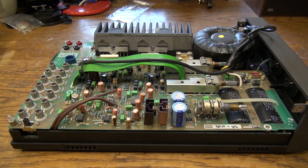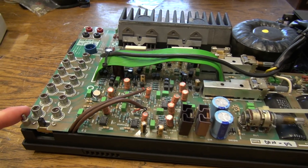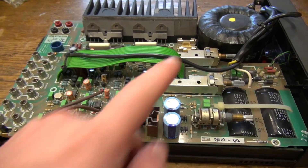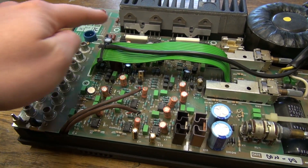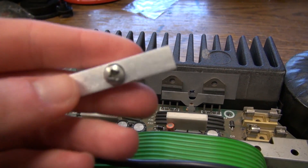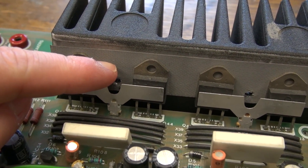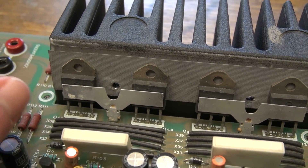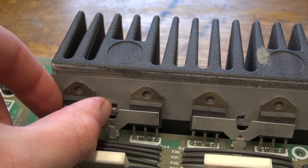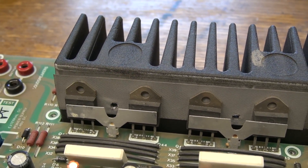What I have done so far is I removed the four screws holding the top cover in place, and also removed the grounding screw for the phono input. You can then remove the top cover, take out the screws all around that hold the circuit board in place — and don't forget that one screw right there. Then it gets a little bit tricky. You want to remove this metal bar that pushes the output transistors against the strip of insulating material. Then you want to take a tool to grab these transistors and carefully wiggle them around a little bit until they break free.